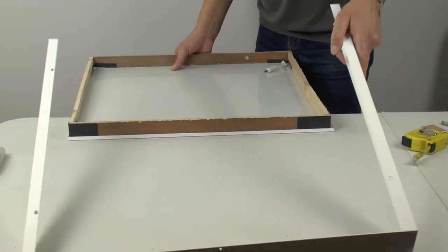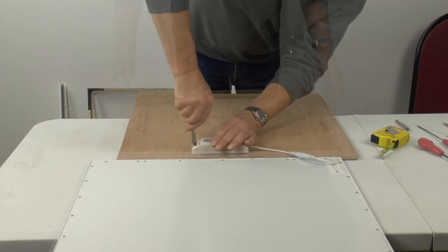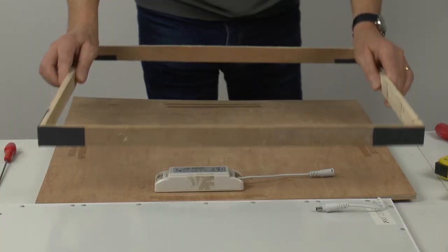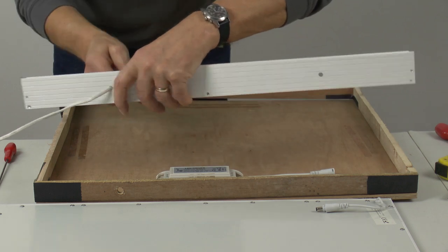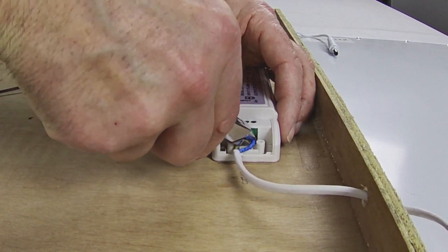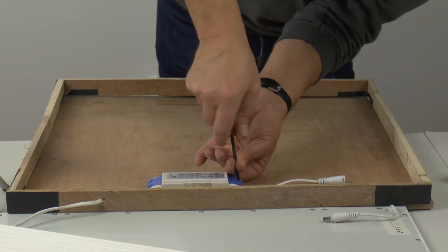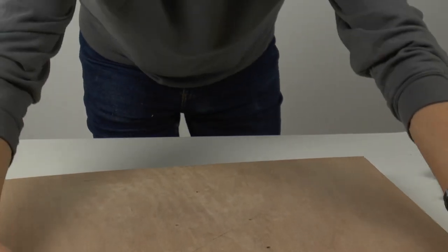Next, slide the support into the mounting box and check for a tight fit with the plywood off-cut. If everything is okay, pull out the support and the light panel. Now lay the backboard next to the panel's power input and screw the LED driver to the plywood. Then place the support box on the backboard — and don't forget this bit — thread the power cord through the loose end plate first and then through the hole in the side of the box. Attach the power cord to the driver, making sure you've got the correct polarity — live to live, neutral to neutral — and replace the safety covers. That completes the internal work, so flip the combined backboard and box over on top of the LED panel.